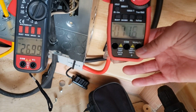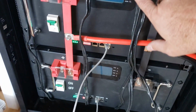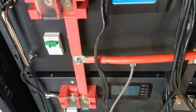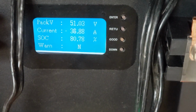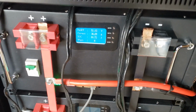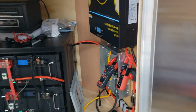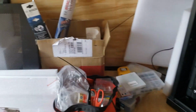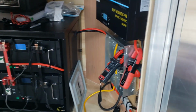And it goes in that room, which feeds back underground to the well right there. Time to do a temperature check. So I'm gonna check AC wire, 63 degrees. DC wire is 65. Air coming out of the inverter is 79. Bus bars are 55, but it is 49 degrees in here. I'm going to check the SolarEdge.